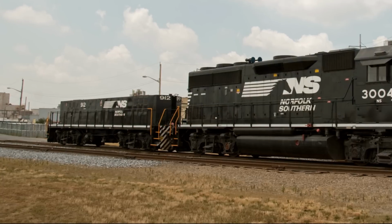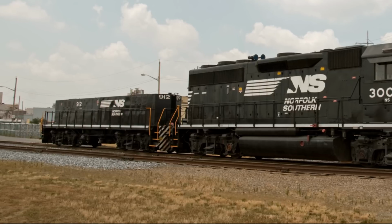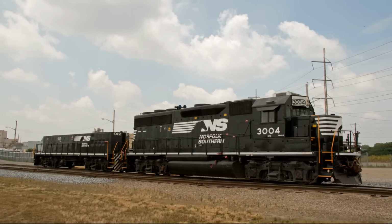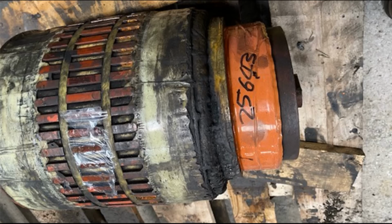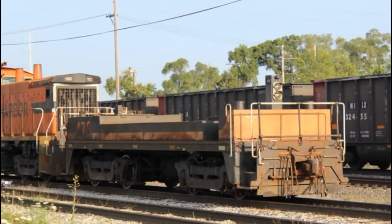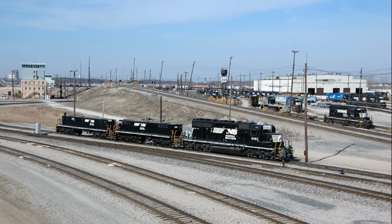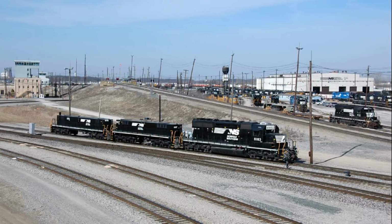At slower speeds, the prime mover in the diesel-electric locomotive is capable of producing more electricity than it's actually able to use. And while extra power may seem like a good thing, in terms of locomotives it's often not. That extra power often leads to wheel slip, or in worse cases overheating of the traction motor. When in use, the slug will increase the number of traction motors available to the locomotive, and help to increase both the pulling and braking force. Essentially, the slug is adhesive weight, which allows locomotives to run at full power at slower speeds.